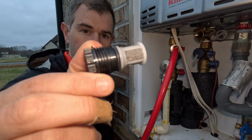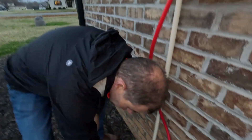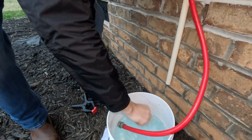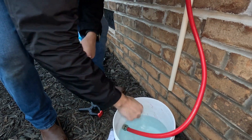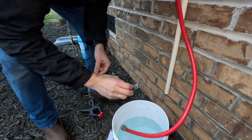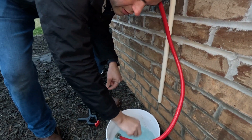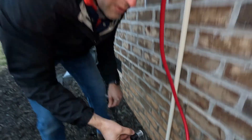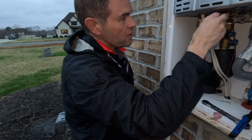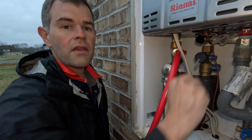And then you'll see that there's a small screen right here, and there's little small particles on there. So what I'll do is take it, put it down in the water that I've already used to flush my pump with, and sometimes you've got to bang it around a little bit. Get all the things off the screen — you can also use a small brush to do it — and you'll clean out all these little particles. Then once it's nice and clean, just put it back in and tighten it back down. And that is how you do your entire system. Let me know if you have any questions.